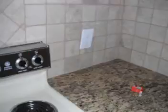Out there in the kitchen, here we are, next to the cooker. And it's exposed, it's not fixed into the wall, so that's dangerous. No GFCI there, well it doesn't need to be. It's got to be GFCI here, and it is. It's there. Good.